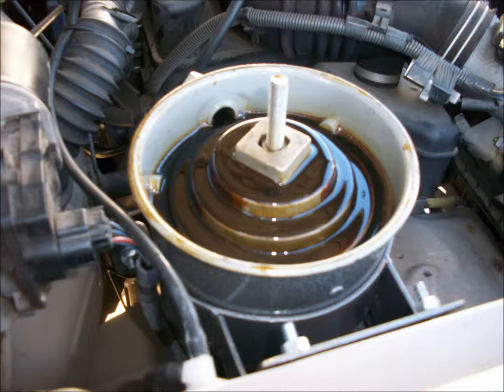Now, once the oil flow rate is established, regulate the valve that's at the bottom of the canister so that you have a slow, even flow. Once that is established, idle the engine up to its normal operating speed and re-establish the slow, even flow with that regulating valve.